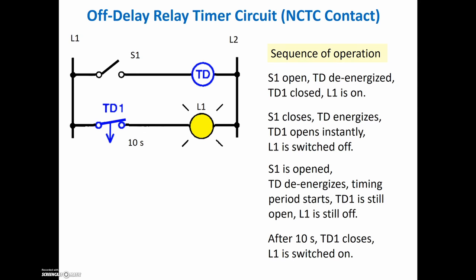Hopefully that helps you understand what an on-delay timer and an off-delay timer does. The next videos in the playlist will look at a TON timer and a TOF timer, but you can always revert back to this pneumatic timer to understand the different components. The enable component is the actual coil, the done bit is the actual contacts, and the preset value is like adjusting this to change the time it takes for the contacts to change state. On-delay needs to be energized and takes some time to change state, then reverts right back to its rest state when de-energized. An off-delay requires you to energize the coil, then de-energize it — that's when the timing happens to revert back to its rest state. Thanks for your patience — we'll see you on the next video.